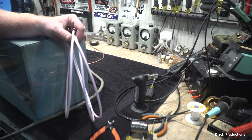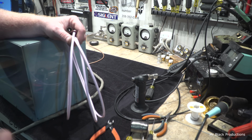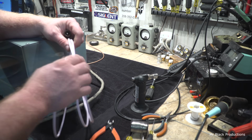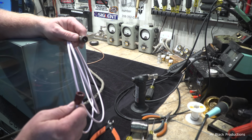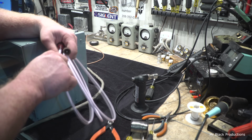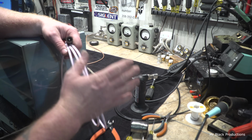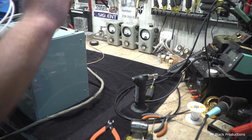I'm not a big fan of these units that don't have a meter in the power supply. If the meter in the amplifier fails, it's one thing. If the power supply is inside the amp and the meter fails, it's different. But when you have connections like this externally on something, this is really dangerous. If the meter in the amplifier unit itself fails, you have no other means to know if there's voltage still on the supply or not. Yes, there are bleeders there, but it's inherently very, very dangerous.